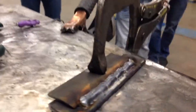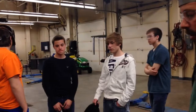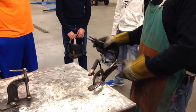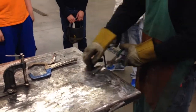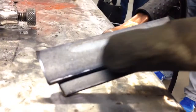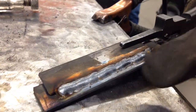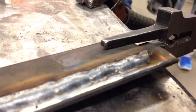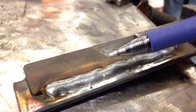So a couple things with this — it's really hot now. Don't bring it to me and say 'grade this' while it's molten hot. That's an instant F. We normally have a quench pail next to the hose, which is just a five-gallon pail. Take a pliers that's not tethered to the table, carry it over there and quench it. How is my weld? It's decent — not perfect as far as the pattern goes. On the backside we've got good heat penetration — I can see a change in the color of the metal, so I know I've got good heat through the backside. That's important. My pattern's pretty consistent and I don't have undercutting for the most part — there's a little bit of undercutting right here where it's kind of tucking underneath. But I've got pretty good wetting through here, or flowing down into the base metal, and that's important.